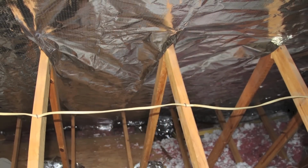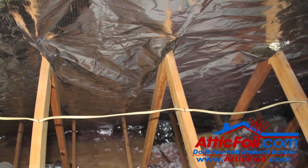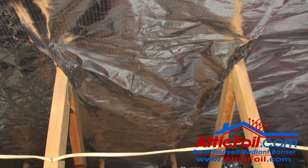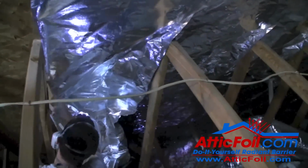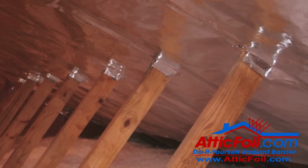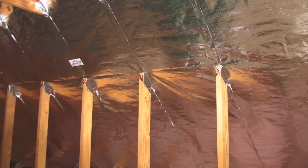It's okay if it's got some wrinkles or gaps or cracks. You'll notice that they just staple around the jack supports coming up and leave little flaps. You can spend 2 or 3 times as long and trim around every one. It will make it look a little prettier, but it doesn't change the effectiveness one bit.